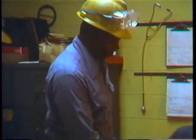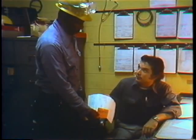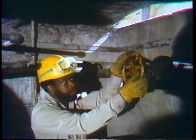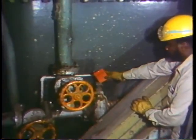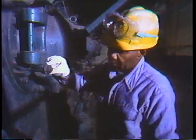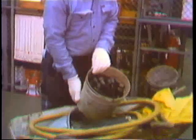Mel has just got a work order to open and inspect the water boxes of the main condenser on turbine unit number 12. In Mel's plant, the operations people are responsible for shutting down the associated systems and draining the condenser. Equipment tags are placed on all valves and controls to be sure they're not operated — this will prevent unpleasant surprises while the job is going on. While he's at it, Mel checks the size of the hardware so he'll have the right sized wrenches.